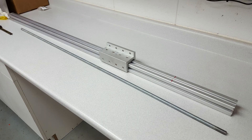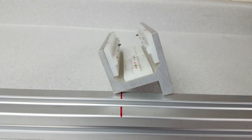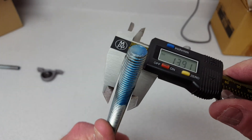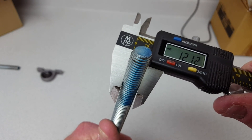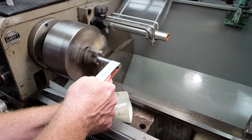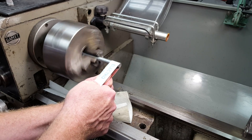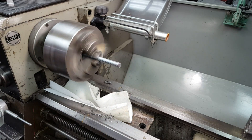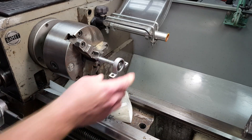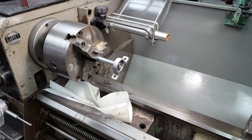The backbone of this unit consists of a 4-foot-long, 40mm square aluminum extrusion and a neat little linear bearing with Teflon sliders that I already had on hand from a different project from years ago. My lead screw is nothing fancy — just a piece of half-by-13 all-thread rod from the hardware store. Because the all-thread measures about 12.2mm outside diameter, I decided to buy a couple of 12mm bearing blocks from Amazon to support the ends of the all-thread. I took the all-thread over to the lathe and spun it while sanding it with some emery cloth to bring it down to 12mm. The beauty of this method is that you don't have to have a lathe to resize something like all-thread and still make it concentric — you can chuck it up on a regular drill, support it between a couple of pieces of wood, and still sand it down nice and concentric.